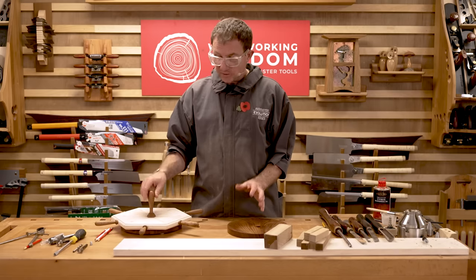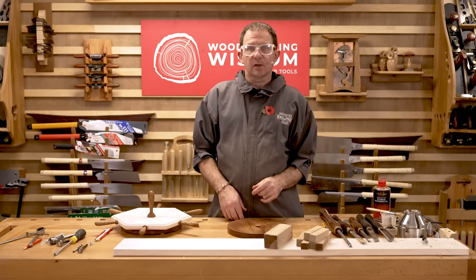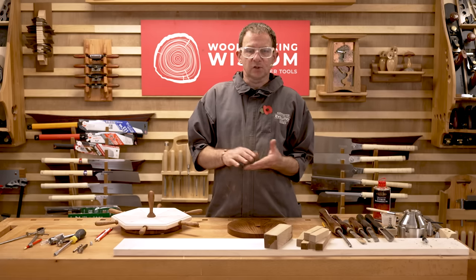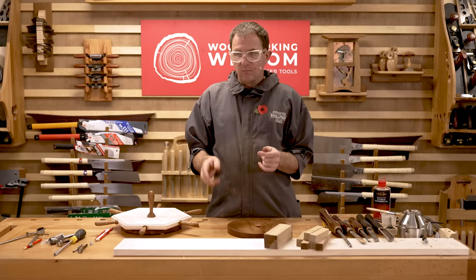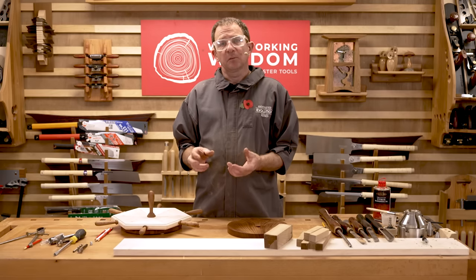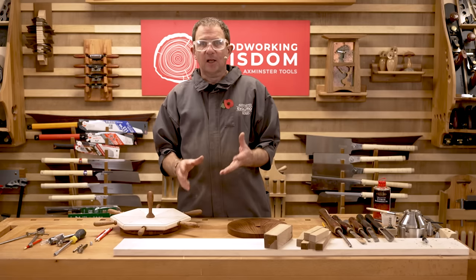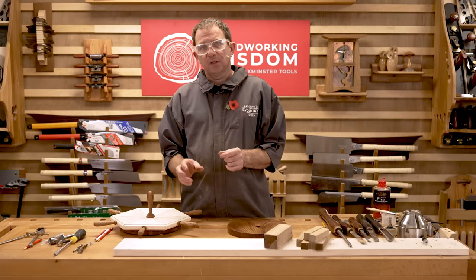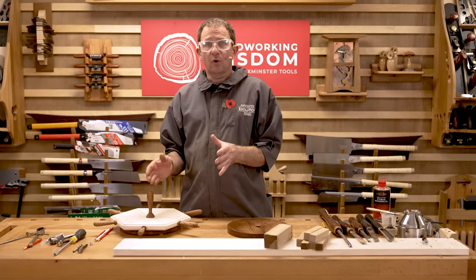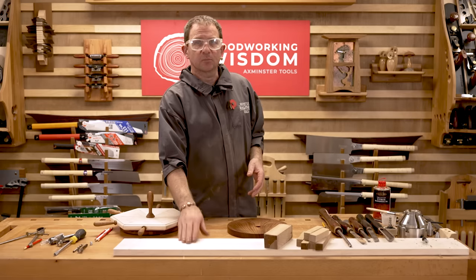So really at this stage, the next bit we need to do is cut our bit of sycamore to those six bits. Okay, that takes a bit of setting up. We've set the chopper up next door. We're going to have a look. We've got the mitre saw there ready to go. In reality, if you divide this 360 by 6, you're getting a 60 degree angle. You need to be patient and set it up, because if they don't come together nicely, it doesn't look good. So this bit can take a bit of time to set up, and patience is the thing. I'd use some scrap wood or a piece of plywood first to do your six, see how they come together, then cut your expensive material.